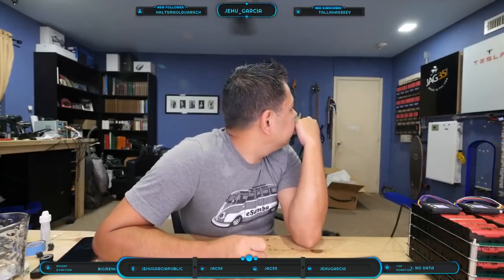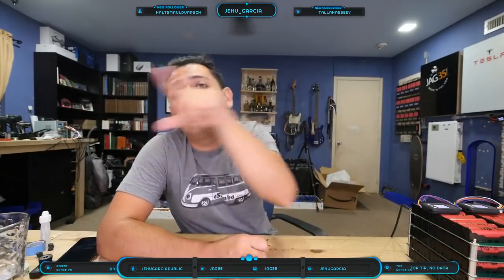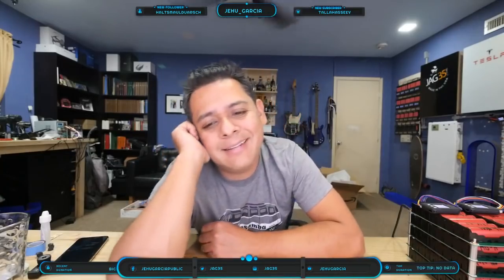By the way, guys, I like the Sand Flare a lot more than the light-colored one. At a glance, I can tell what the charger is doing. For each one of the cells, I can see where it's at, what's the voltage, and when it's done, it's easier to look up. I don't have to press a button. On the other ones, the light's off, so you have to press the button to see what cell number 1 is doing. It lets you know it's done, but if it's not done, you don't know how close it is. And then what ends up happening, they change the program. All of a sudden it just goes to charge, and if you're not paying attention, you don't realize you're charging on the last cell you loaded. I don't like the lighter colors as much.